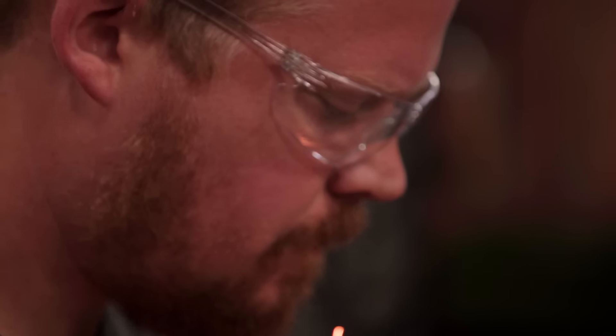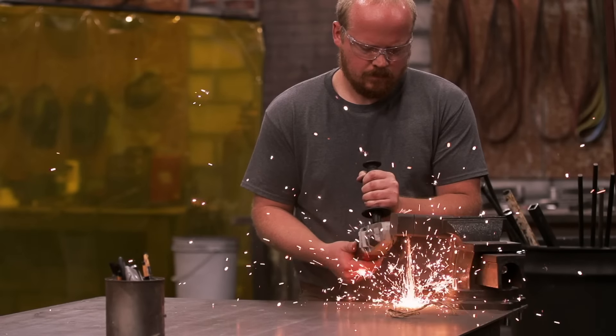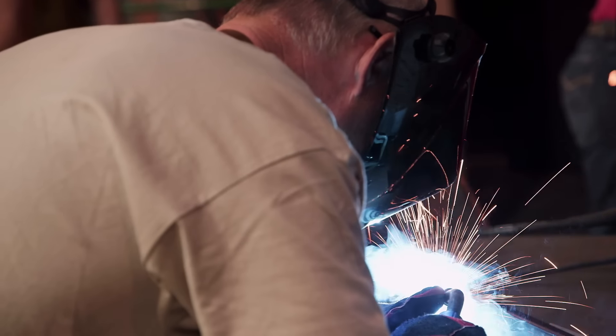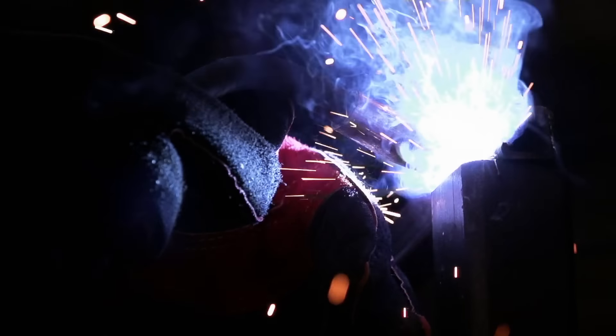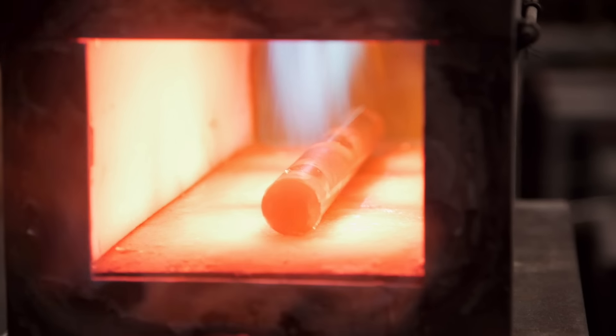My plan is to get the hammer done first. That hammer is everything to me. I've had little experience with larger equipment, so I need to make a hammer that I can forge my blade with just as well as any of my own tools. My plan is to weld the square tubing onto the top of this piece of mild steel — that's the quickest, easiest way for me to get that hammer made, so I can put my steel in the fire and go.